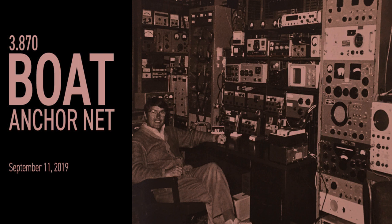I'm copying everybody pretty good, even the mobile station. Looking at my scope, I can see I've got some carrier on my signal I need to take care of. After this transmission, I'll put it on a dummy load and get it out of there. I got back last Friday evening, and I should have checked this out before I got on the air tonight, because this rig hadn't been on the air in 2 months. It moves around a little bit, the tube's aging or components or something, and a little bit of carrier will sneak in every now and then, but I can adjust it out.